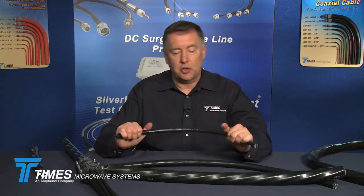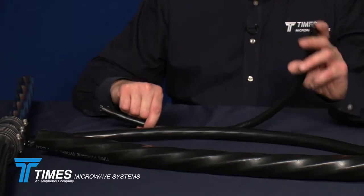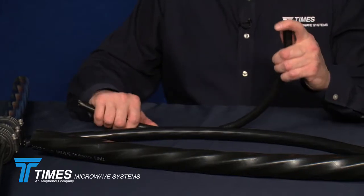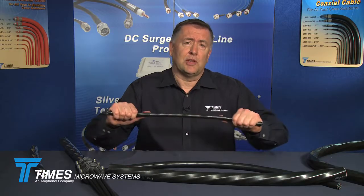We have some very small core bundle cables. This is a 4-conductor LMR 240, and its overall diameter lines up nicely with 1/2-inch corrugated hardware. So you can use off-the-shelf hardware. Running small 240 cable up the tower, if you're running low IF frequencies, may make sense from an electrical standpoint, but from a ruggedization standpoint, it's nice to have that extra level of protection.